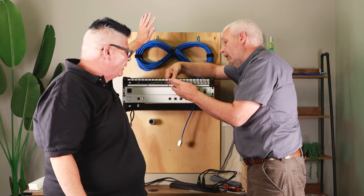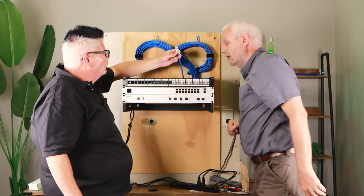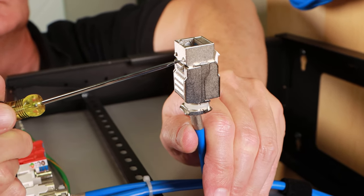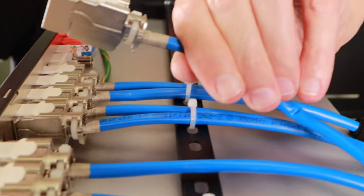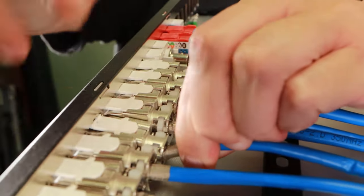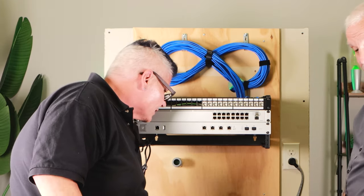Dave's got most of these runs snapped in. Before he puts in the last one, I want to stress the shielded keystone — you've got two lumps of metal, these nubs here. This is basically your fulcrum point and it's going to grab onto a piece of metal at the rear of the patch panel — the silver piece of metal. You put it in at an angle from the rear, it grabs onto that piece of metal, you use that as the lever, then seat the keystone and it snaps at the top.